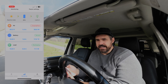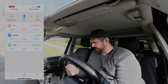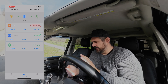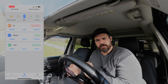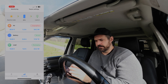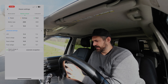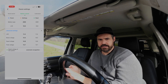Today it's cloudy and a little bit dusty, so you can see we have 36.8 watts. The best I've had here was 70 watts just standing in the sun. When you first plug it in, you need to set up your system — don't worry, there will be no problem if you haven't done it before. Simply go to param settings, then device param and battery param. In battery param, I've set it to AGM because I have an AGM battery.